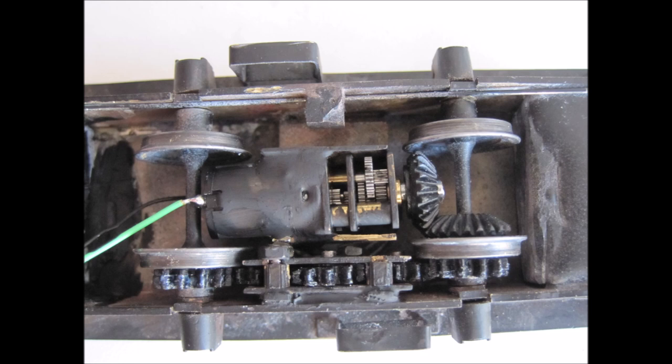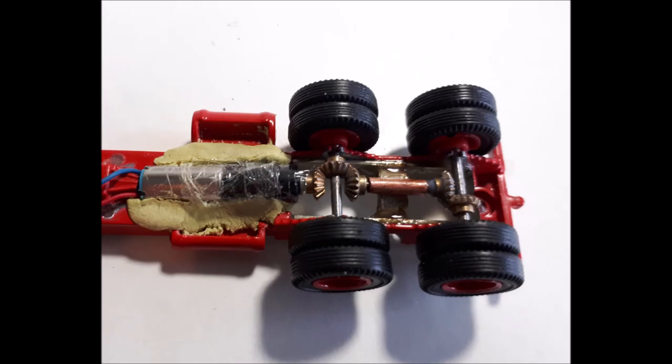The crane would probably push or haul anything on the layout. I rather think these laser cut gears would probably not be suitable for high speed running, but for nice low speed stuff they seem absolutely fine. Each gear is made from three laminations of 0.8mm and they run on 1.6mm silver steel axles. If I was making this now, I'd use a slightly different arrangement.